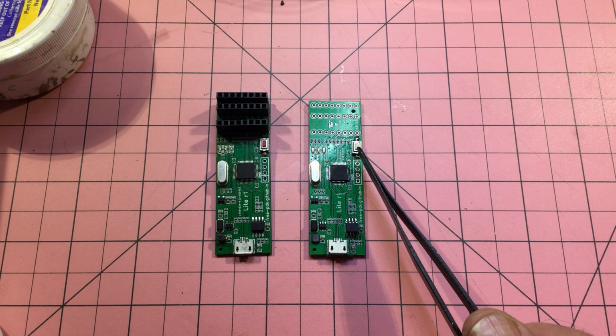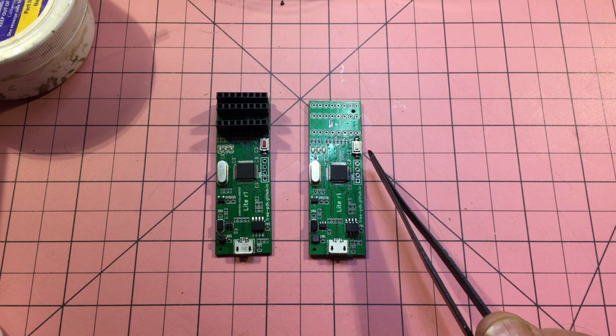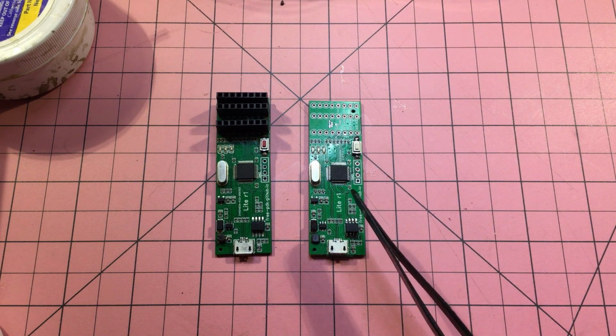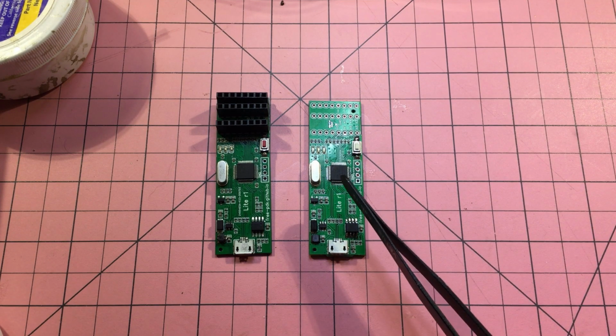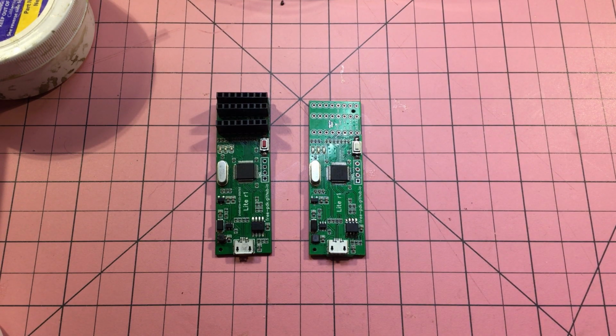And it struck me that these two were different. So I did a test on this one, and in fact, the button is not firing the whole time, which means the STM32 doesn't go into programming mode, which means you can't actually put on the firmware that's required before you even start the process of programming other chips. So I'm going to swap the button out and see if that works. It's crazy, but it might just be the secret.